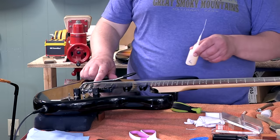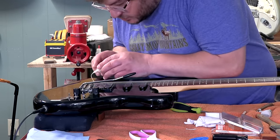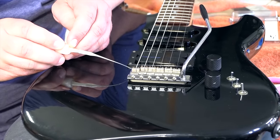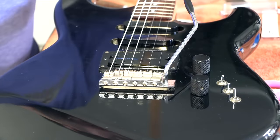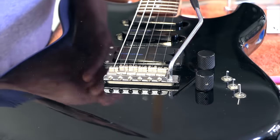On these front screws here, you can take a little bit of Tri-Flow and just wick. You don't want to put much. This has Teflon in it, so you don't want to get it everywhere. But you can take this and just wick it under the screws if you like, all six of them. Then you can also take a Q-tip and wipe up any excess.